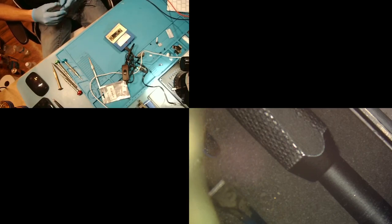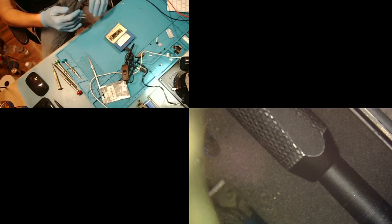Now, on the 12 and 13s, what I would do is use my board heater and my hot air, essentially both, because the 12 and the 13s have a much higher melting point to split that board. So just using the board heater itself, or at least this particular board heater, isn't really safe. You're definitely going to have some issues with that, as I've had in the past.